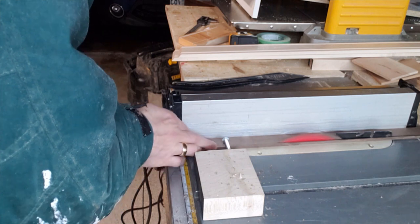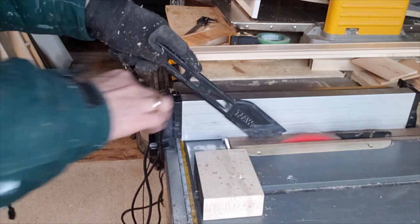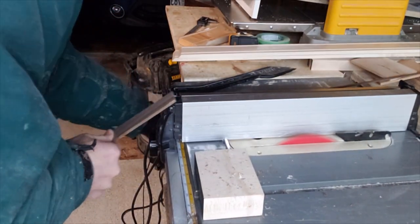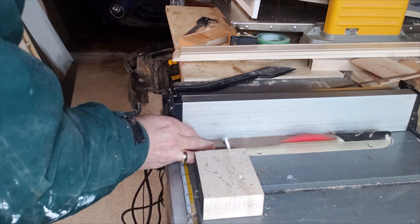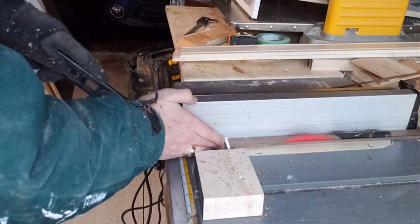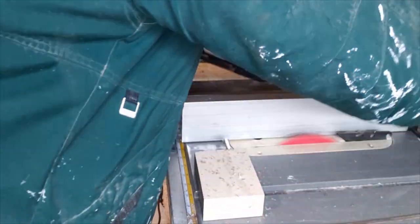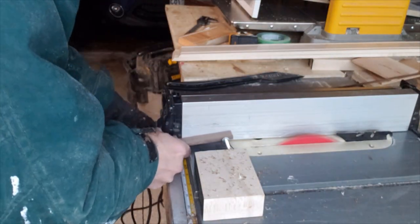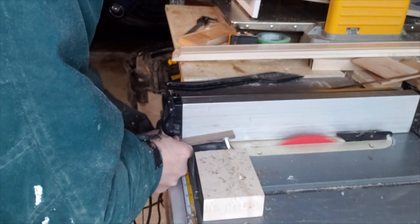For the inlay, all I did was use my table saw to rip a strip down the middle of the board and then use my thin strip cutting jig to rip some pieces of walnut to the correct width. The thin strip jig is not my own creation — I got it from Tamara at 3x3 Custom, who got it from Colin Connect, who probably got it from somewhere else. I'll put links in the description to Tamara's video, but I like this jig because the thin pieces I cut are usually longer than the infeed side of my table saw.